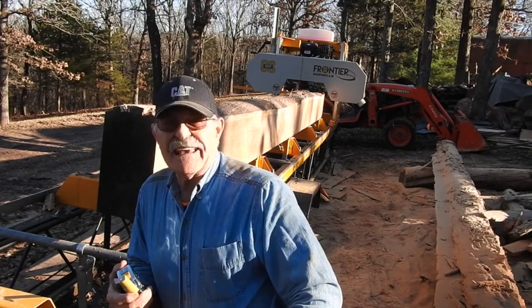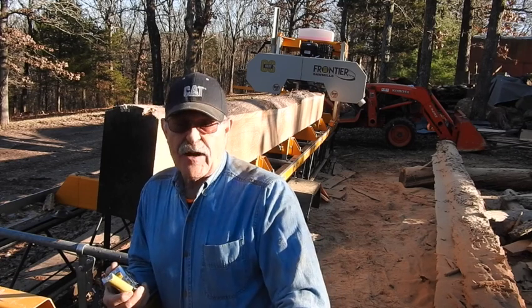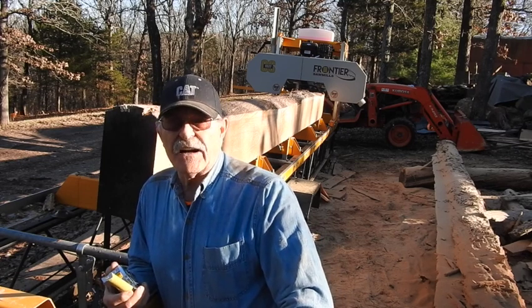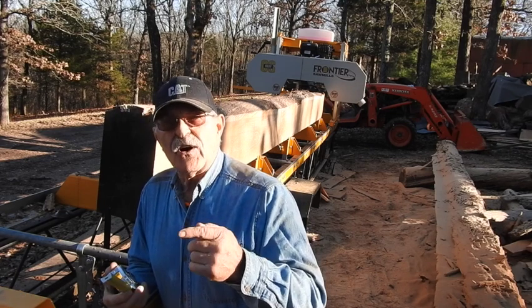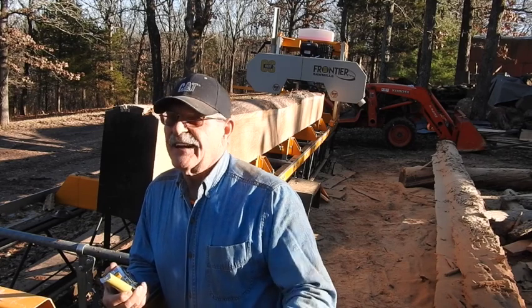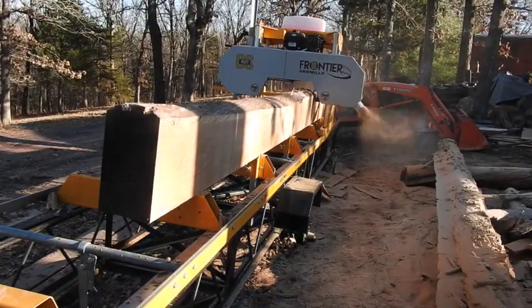And I think I'm on the key to where I was messing up with the sawing the oak before. It's all about the speed of travel through that blade. I'm trying not to crowd it at all. Consequently, it's cutting a little slower, but it's cutting smoother. And so far, I haven't jumped the blade yet. So I'm still contending that was operator error on the ones where I was jumping that blade in the oak.